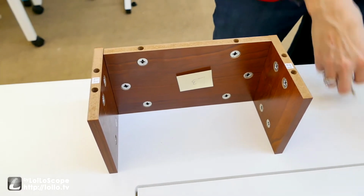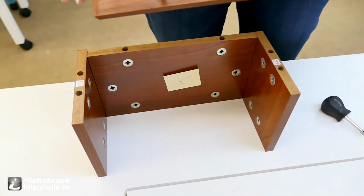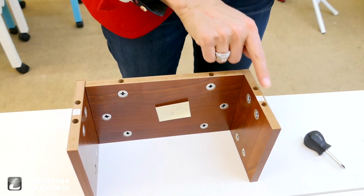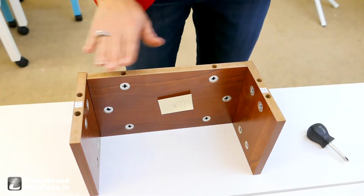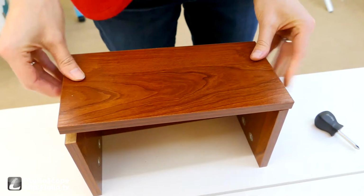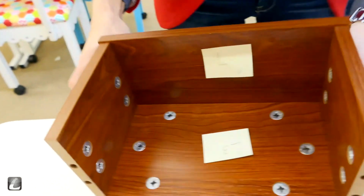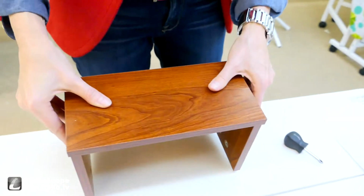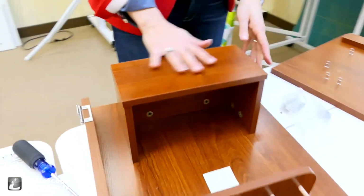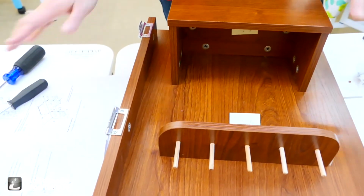On step 10, you're going to gather your L1, your L2, your L3, and your L panels to make your little drawers. And essentially, you're attaching your L2 and your L1 to the sides of your L3, and then you're going to pop your L on to all 3 of those, and then make sure you tighten down all of the cam bolts that are associated with that, and it'll make a little box. And you'll notice over here on V1, this is how it's going to look on your door. And this leads us right into step 11 then.